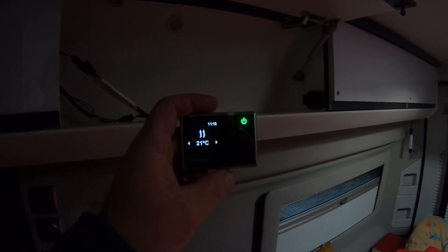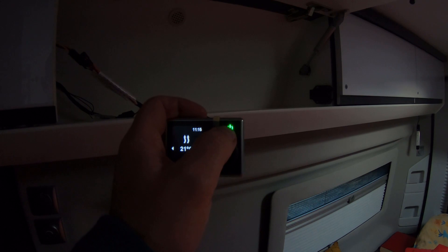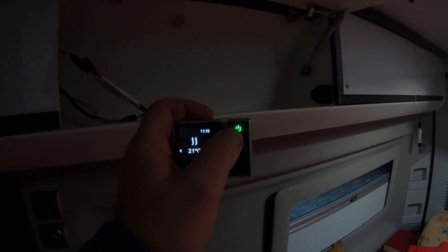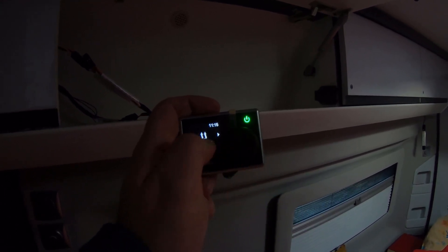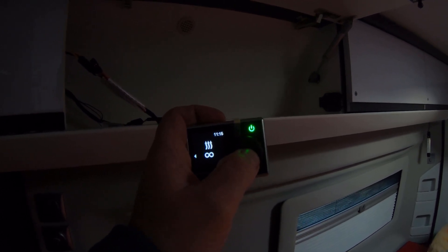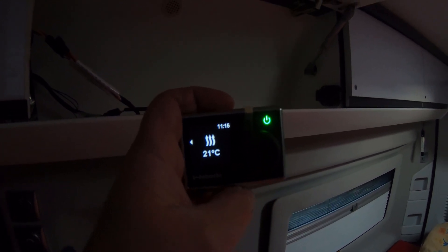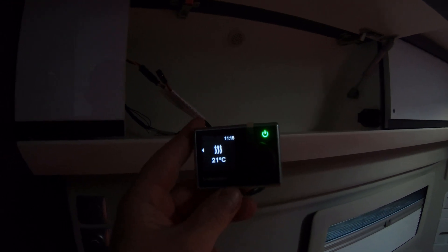I've tested it now and it's running okay. When you first turn it on you have to set the date and time. The green button — the on/off button — when it's green that means it's started up straight away, which it has done. If you press the middle button you can set the fan speed: three bars, two bars, or one bar. Push it again and you can change the temperature to the room temperature you want, then press the button again and that's set. With the front panel disconnected the heating system is up and running, so now I just need to pull it back and stick the control panel to the wall using gorilla double-sided tape — they do give you some sticky pads as well.